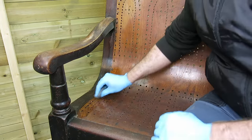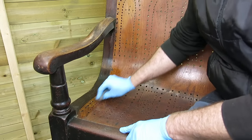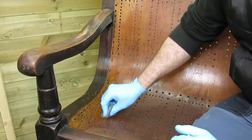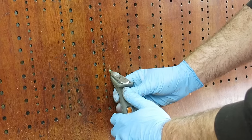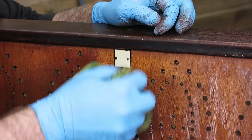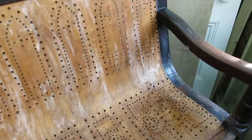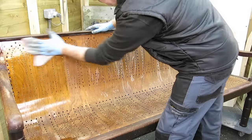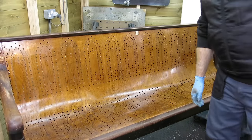The other good thing with doing this — because it's a very fine steel wool — is it's actually cleaning up those brass nails as well, which will save me a job further down the line. I'll just wipe that back and have a look. There you go — a bit better. This is how it looks after I've been at it with the methylated spirit. I'll just clean it over now with some white spirit, or mineral spirit, and see how it looks after that. Lovely.